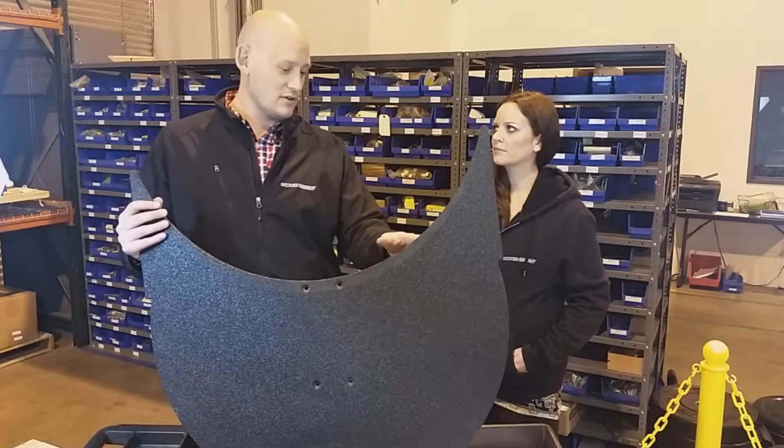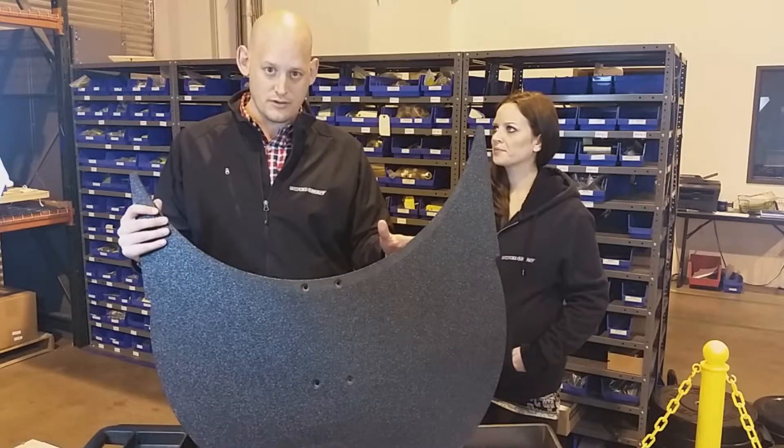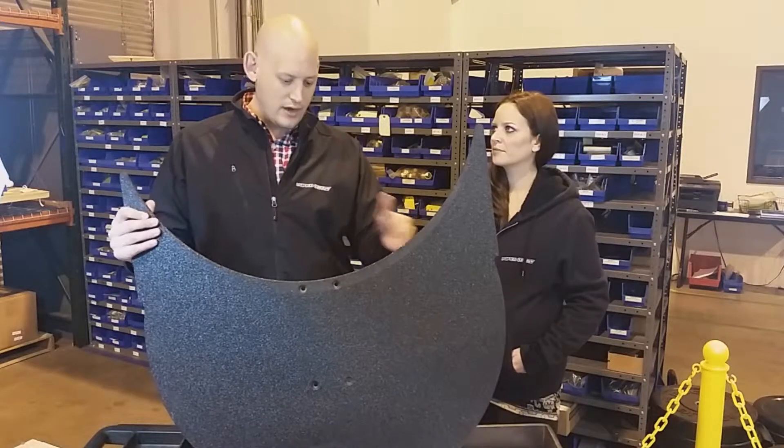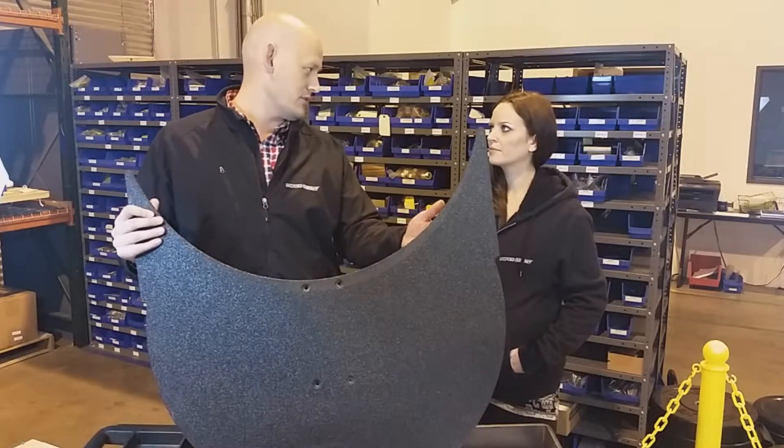We have to use a special high-quality steel to make sure you get the level of flatness that you need. It's incredibly important on these particular parts so that you don't create gaps — if they're bowed either front to back or side to side, it can create a real problem with the carousel.